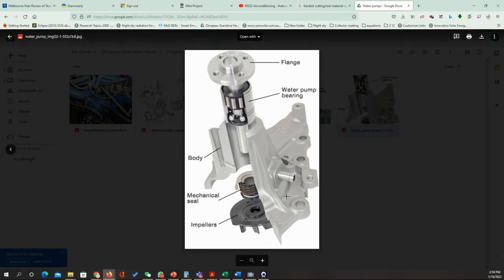If that shape is going to be sand casting, and I get to remove this part, it can simply be done by die casting. You know that die casting has a higher production rate, and the manufacturing time and cost are reduced, so we can save some money in this process. So both the impellers and the body can be made by different manufacturing processes.